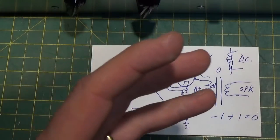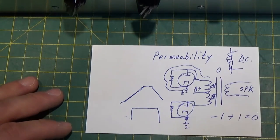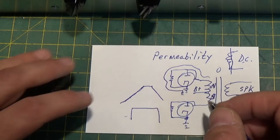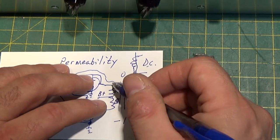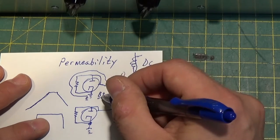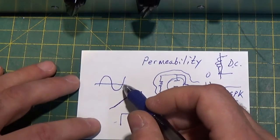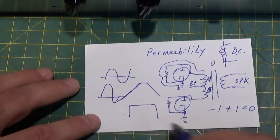So the type of core material you use is very important. In order to carry a lot of current, a lot of power, you have to have the type of iron used in an output transformer. The bad part of that is you can't just put a DC voltage on it. It will saturate very easily and even magnetize in some instances where your transformer will actually become a permanent magnet — a weak one, however — but what that's going to do is distort your waveform. If this iron is magnetized in one direction or the other,